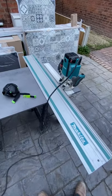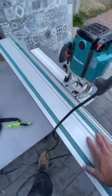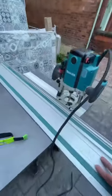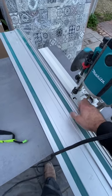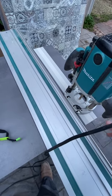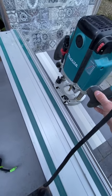We only had 2 mil to play with. If these panels come from a cutting house, they're cut to size, so any discrepancies in the wall you'll have to have minimal amounts of play on it. But considering we had 2 mil, that's tight enough — once they've got a lick of paint on there you wouldn't even see it. So this is my setup now for the male cut. All I've done is used a track saw — it's got a nice flush flat edge, it can be clamped to the underside so there's no movement. Set it back whatever you need — in this case it's 64 millimetres from the gauge to my router cut line. Once I've set all that up, just run it along to make sure that my blade is going to hit the line all the way along. And now it's ready to cut.